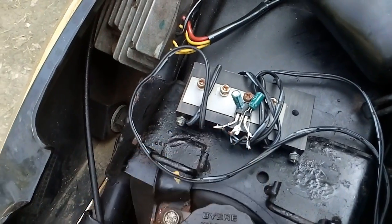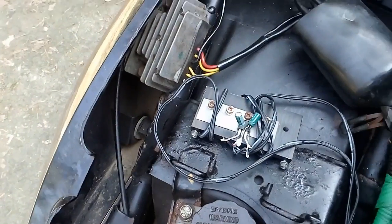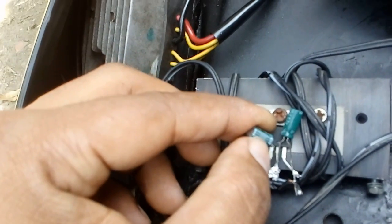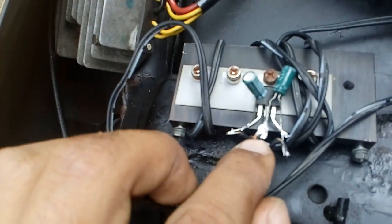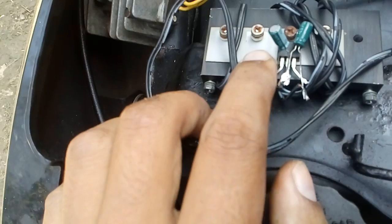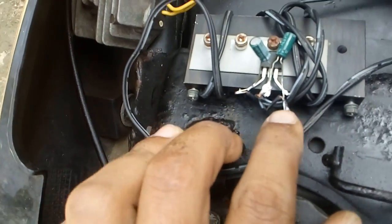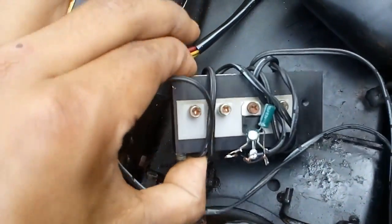You have to connect two wires from the battery — the negative black one to the middle, and it is connected to the charger output. The negative sign of the two capacitors are connected to the middle, and the positive long side of the two capacitors are connected to the left-hand side and the right-hand side. Here is the charger complete, and this is the heat sink.